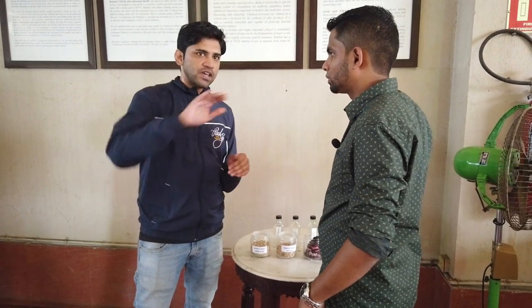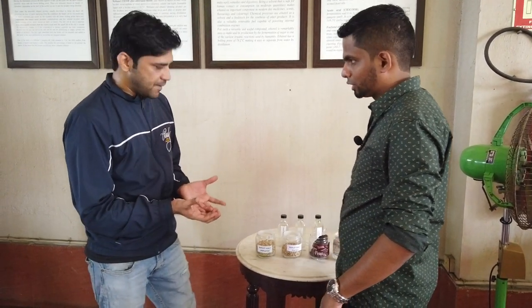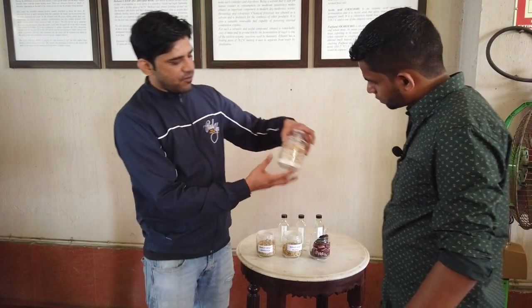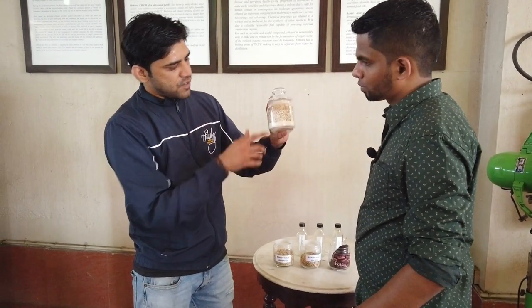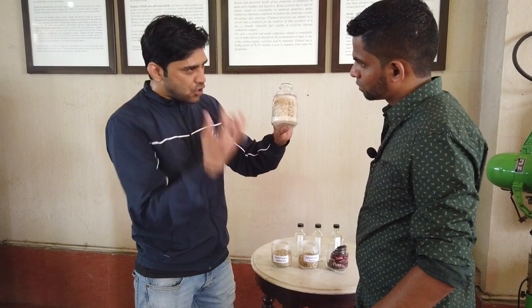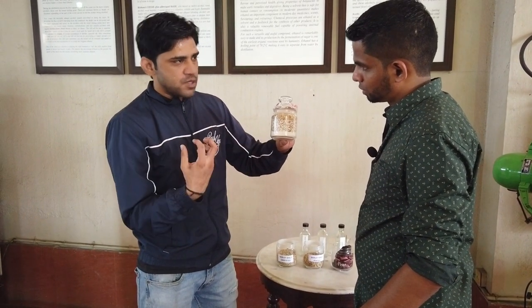That's true. So now malting has been done, the barley is sent to us, and we got rid of the stones and other impurities. So the next step is for us to break the barley into parts, or grind it, or mill it. Alright. So when we send the grain to be milled, there's a particular ratio of the grist that we need to ensure. Because if we do 100% flour-like texture, it'll tend to clog up the mill. Understand. And if we do it too coarsely, the water will just run through without absorbing the sugar.